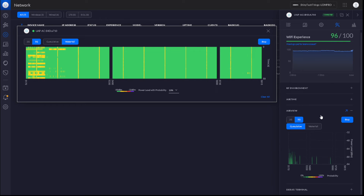That is pretty impressive for this access point. Now tell me what you think in the comments section down below. So with my old UAP SHD, I'm running AirView on 5 gigahertz, and you can see I've got the cumulative as well as the waterfall available right here. From my phone I'm going to go ahead and run a speed test - you'll see the actual activity. This is one of the main reasons why I really like the SHD: I can see what's happening in the air because it has a spectrum analyzer built right in. You can see I am saturating the air here with my phone doing a speed test. There's the upload - now it's stopped. I'll run it one more time. Now it is downloading - you'll see all that traffic down there.